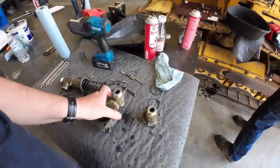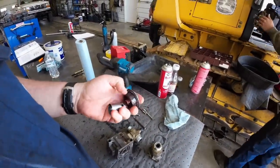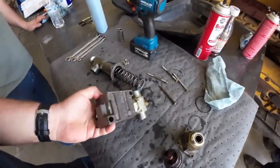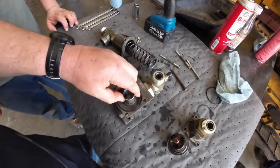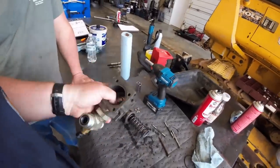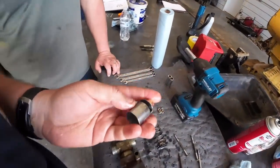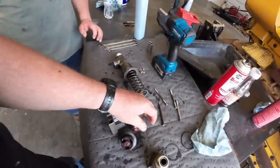All right, so I think we found the culprit. You learn something new every day. I should have checked this. I didn't quite realize how this worked, but this has come apart in there. There's a thermostat in there, like I said, and basically that oil is supposed to bypass and go out these holes right here. You guys can see we've got some wear. There's a kind of a set screw in there. This thing's supposed to ride on that set screw, it's got a flat spot there. What's happened is it's come in here and got cocked sideways, which has blocked all those ports off, thus letting no oil return. So it's been doing that, and it's probably why it busted that apart from there. It was trying to push that thermostat open. I don't know why that failed or why that happened, but you can see that flat spot there. It's supposed to just slide back on that and not spin, but it somehow slid back, got cocked, and blocked all those bypass ports off.